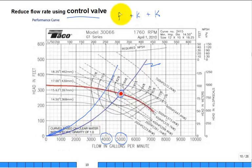and in addition to the f L over D, such that 1/2 rho V squared is equal to... this flow goes down, true, but I've increased the K. I want it to still match the pump. The pump almost is flat. Can you see that? But it has some curvature to it. So let's do it graphically. If you do it graphically, can you see where the new operating point is? Just happens to be where 4,000 GPM looks like it hits right around 300 foot of head gain the pump